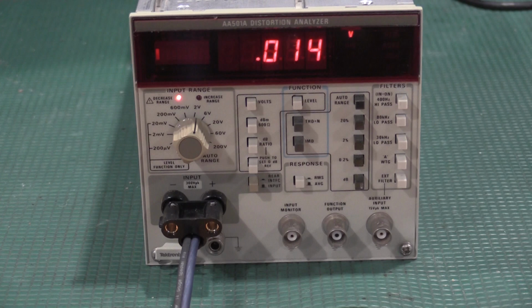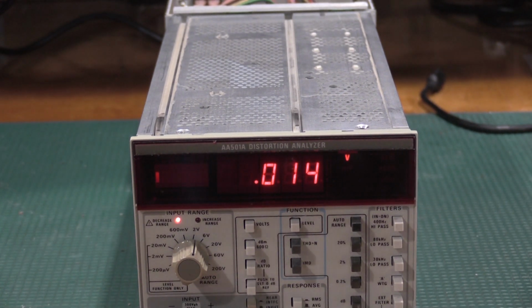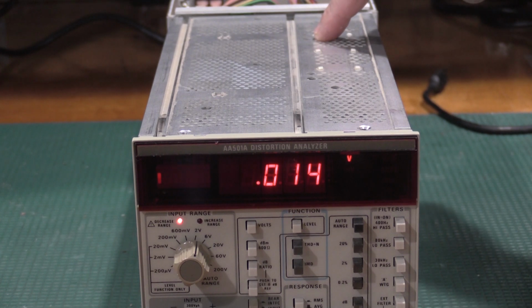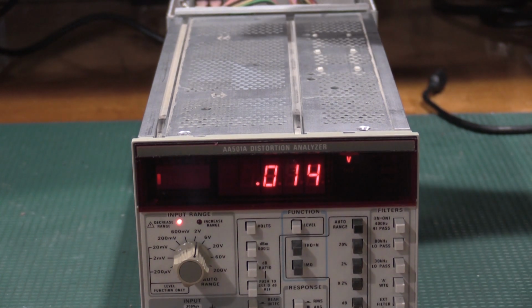Okay, we just have a 15 millivolt signal coming in from the AC calibrator. I need to adjust something on the top panel. Let me figure out what. R1030. 1030 is going to be here. Not the very back hole, the one closer to the camera. The null trim. Make sure this is in RMS. It is. So I need to slowly adjust 1030 until 0.15 shows up.